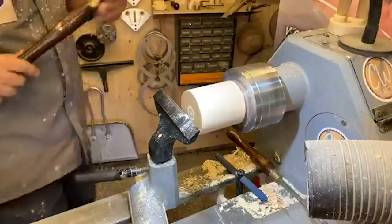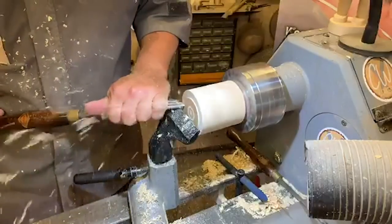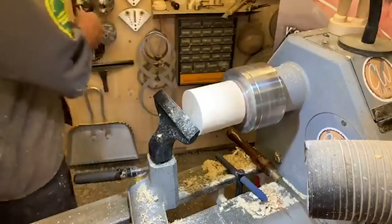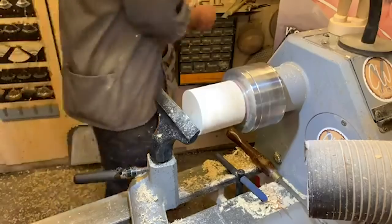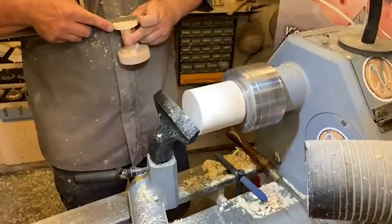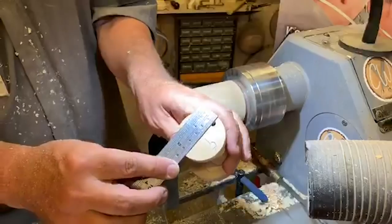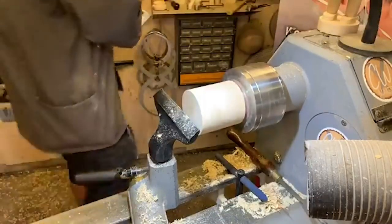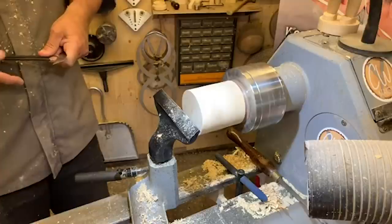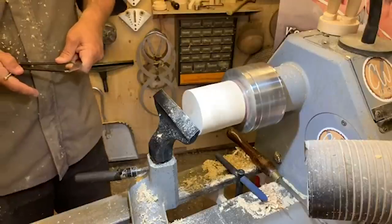I'm going to drill down through this in a second. Now I'm going to make my little recess nice and square. It's got to be deep enough to take the cone holder. I'll do a quick drill hole — just for a depth gauge really. I'm going to measure the overall length. I want to make this 75mm in total outside dimension. So I'm going to drill in about that. Let me get a drill bit — about a 10mm bit. This is just a twist drill. We're going to go in 65mm, and that's my do-not-pass line. Lathe speed wants to be slow — don't go above 1000 revs when drilling.